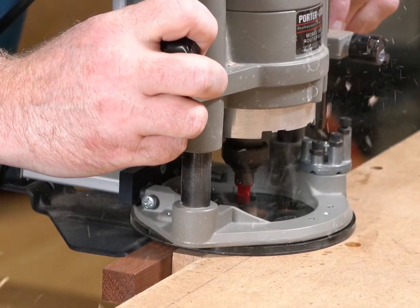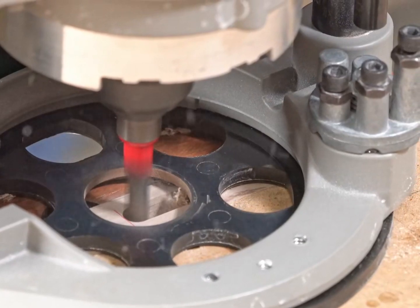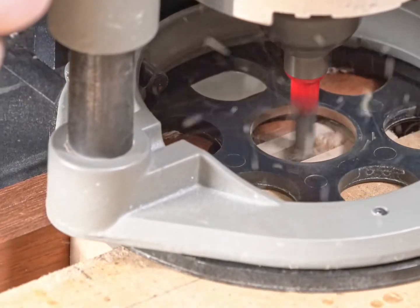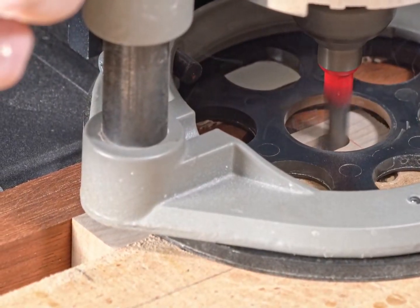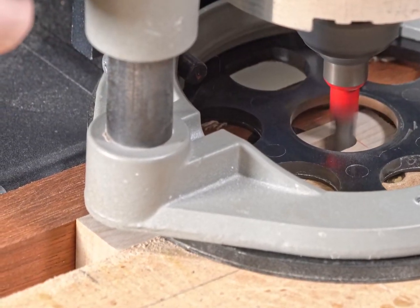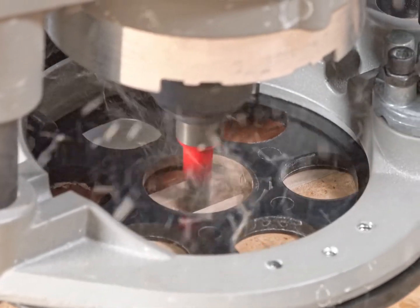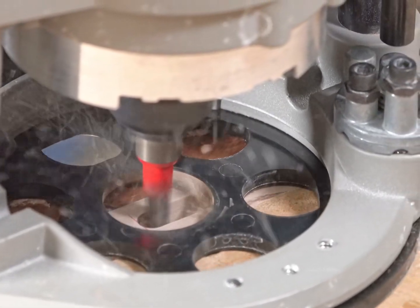The term loose mortise and tenon doesn't mean it's a loose fitting joint, by the way. It simply means that the tenon is made separately instead of being cut into the rails like an integral tenon. I first noticed this wobbling around while plunging when editing the video. This is a mistake in technique, obviously. I'll be more mindful of it in the future.